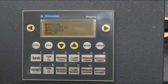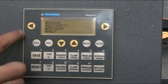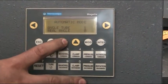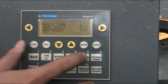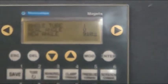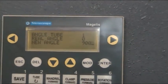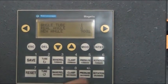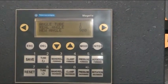We'll go back to our menu and go down to automatic mode. It's very similar to the program mode except you're only entering one parameter. I'll scroll down and modify the angle by hitting the mod button, and I'm simply going to do 90 degrees, which is indicated by 900 — no decimals are entered. Enter 900, hit enter, and we're ready to go.